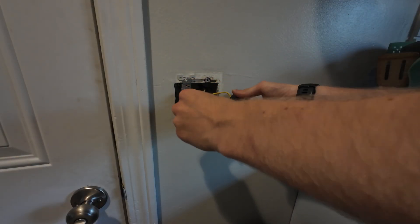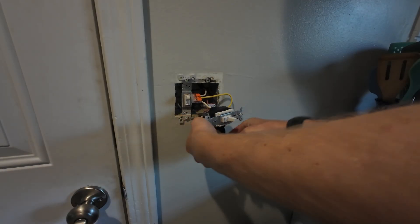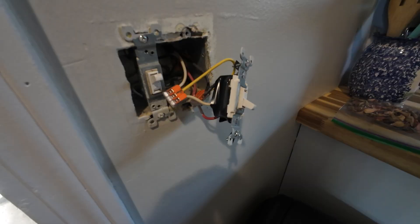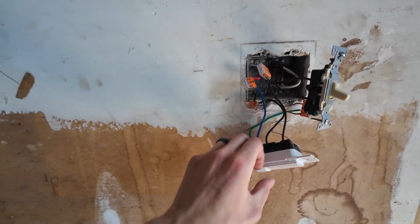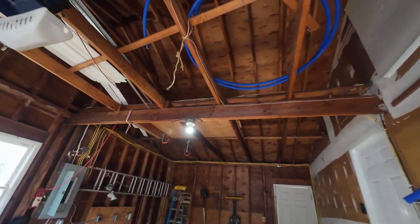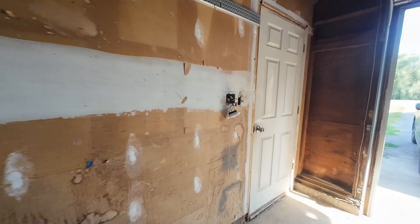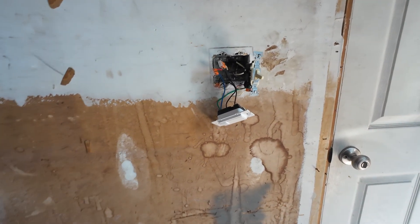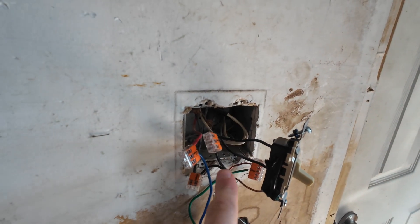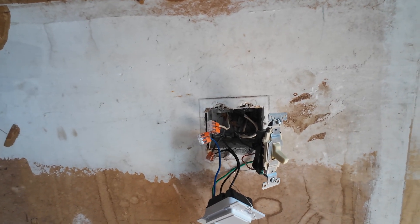Going ahead and wrapping that with some electrical tape because I don't like having exposed conductors. We'll go ahead and turn it on to test it. I've energized the circuit — be mindful — but I'm just testing. There's the outside light. I turned it off. Now I press it on. Then go to this other switch and repeat the procedure — just turn it back on. Just like that, we know it works. Next steps: turn the power back off. A lot of the stuff in here is hot right now, so don't touch it. Turn the power back off, close up everything, make sure everything's taped up, and shove it back in the box.